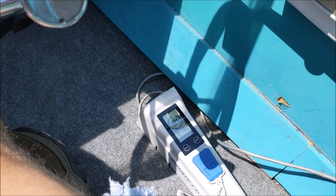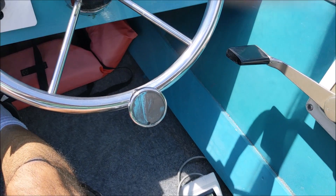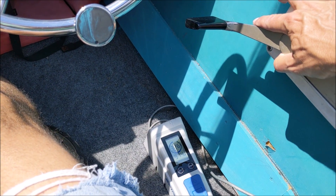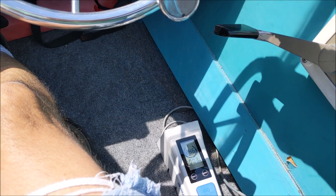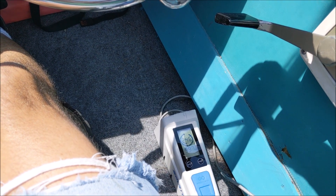The display is calculating the bigger battery bank really well. At 800 watts it's showing three and a half hours. Bumping up to full — 1000 watts — it's showing two hours and 46 minutes. With the old battery, full power would show about an hour to an hour and 15 minutes, so this is a significant improvement.